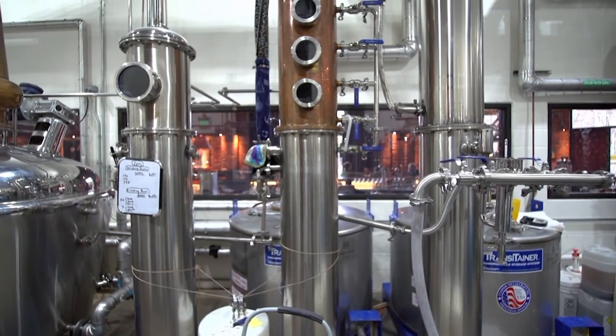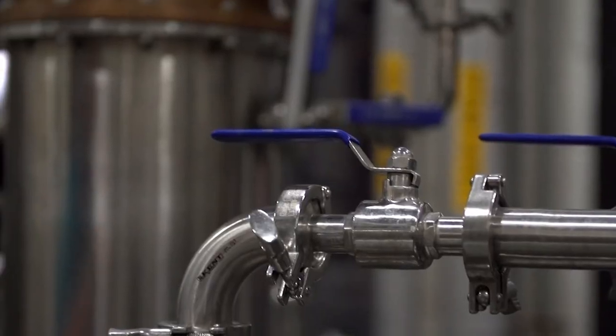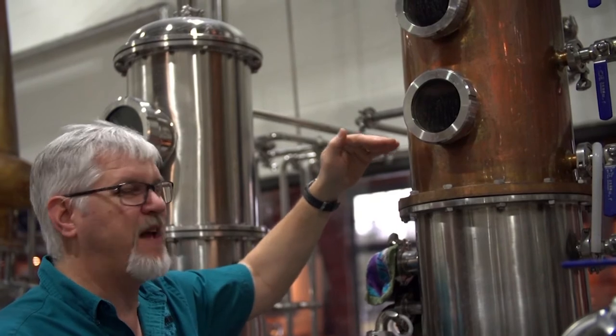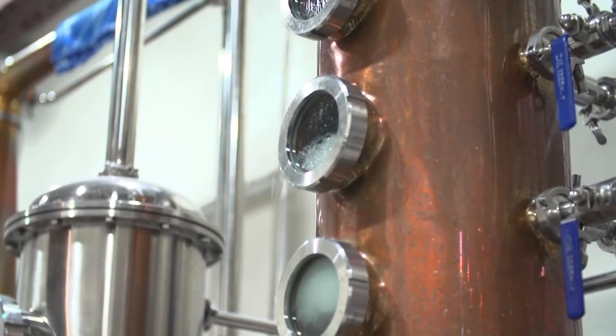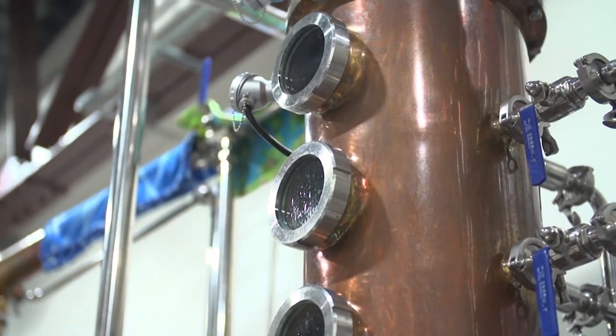To separate them, Jensen uses something called a reflux column. What happens is the vapor goes up through the bubble cap, hits that, and then it condenses — the liquid actually converts from a vapor phase back to a liquid phase. And then there's enough heat going in that some molecules will re-vaporize. As you go up plate to plate, the amount of water gets left behind, and the alcohol content gets higher and higher, and there's a return so that the water goes back to the pot.